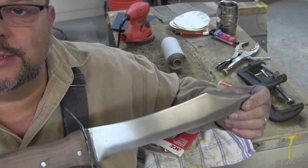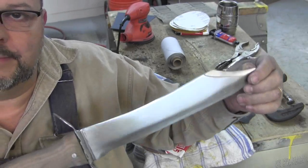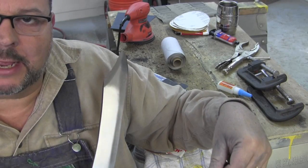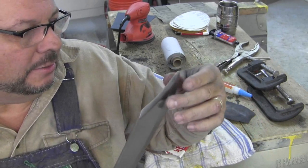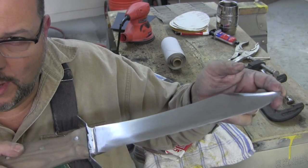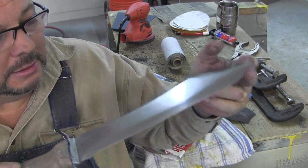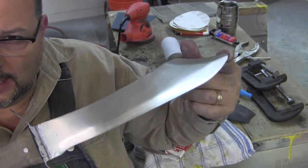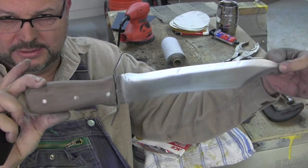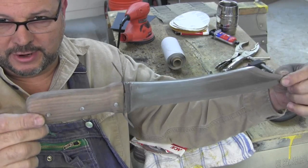That is officially the best I can do. I polished it with the palm sander, polished it down to 220, and then by hand I did 400 wet and then 600 wet. They come out pretty shiny actually — that I'm surprised of. The next step is clear coat. Alright, I'll show you when it dries.